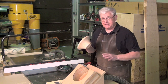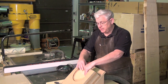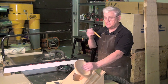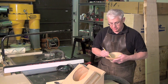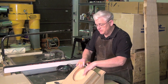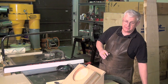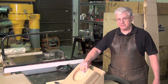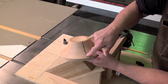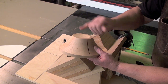For the last cut I've left the blade exactly where it was. I'm going to place the bowl back into the jig and line up a mark on the outside with the mark on the jig. To make sure I get all of them done, I'll make a mark on the inside of the bowl to tell me when I've made all the cuts all the way around. Place it back in, turn the saw on, crank it up an eighth of an inch, then take it back to where it originally was, rotate the bowl and do it again. The first cut shows perfect alignment — it's the same radius as the cope of the bowl and goes down inside approximately a sixteenth to an eighth of an inch, just enough to give a little decoration.